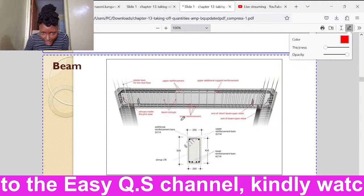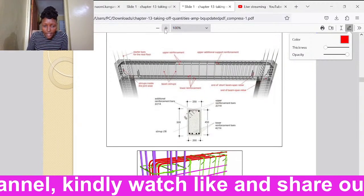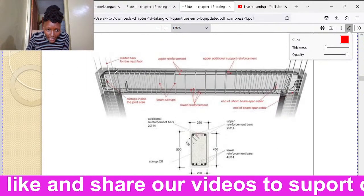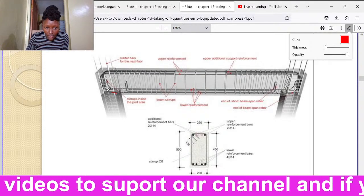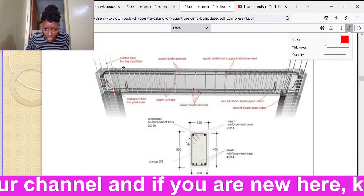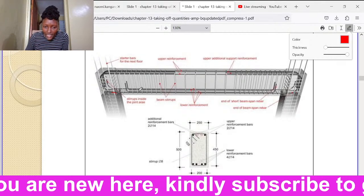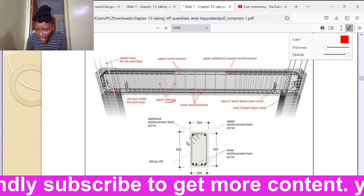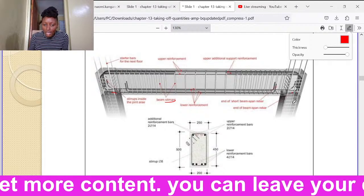I am just showing you the details so that when you are taking off, you can understand very clearly. We also have in a beam how reinforcements are usually tied. They usually have bends that come inside the beams. You can all see these ones. So we are shown there are usually some that are up here and some that are down. They are tied together by the stirrups. Then they come into the column because beams distribute the load to the columns.